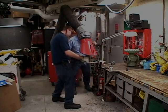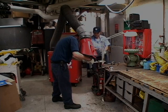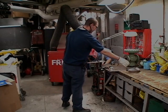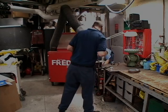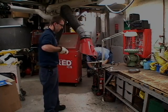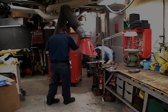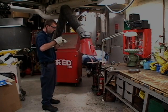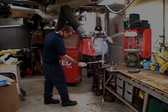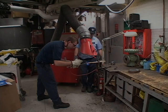In the following clip, the plumbing division employee is wearing leather gloves that are rated for the type of hot work that he is performing. It is important to be sure to wear gloves all throughout soldering or welding processes, since the finished product may still be hot long after bonded. It should be mentioned that the employees also completed the proper burn permit and notified the appropriate personnel. A fire watch person with a fire extinguisher is also present off screen.